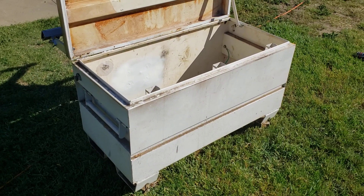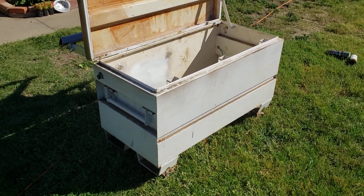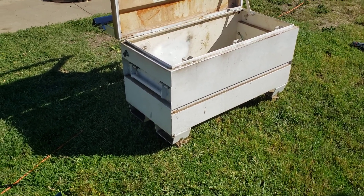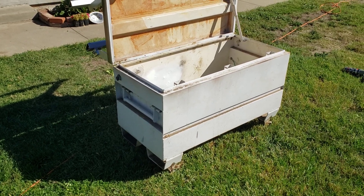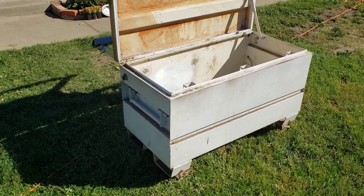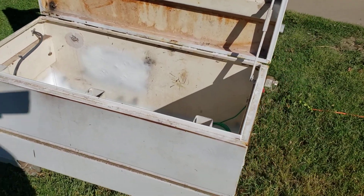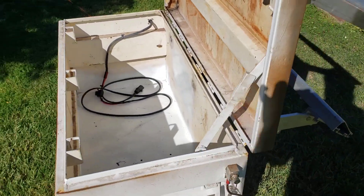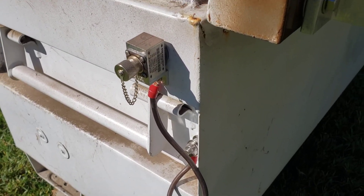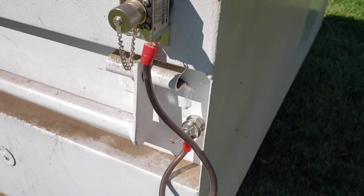Here we have a job box — one of the smaller ones. If you want a more permanent site for your repeater but don't want to build a concrete building or put in an overseas container, you can put your radio equipment inside a job box. You don't need any venting if you're using a lithium-ion battery, but if you're using lead-acid you definitely want venting. The coax coming into the box has a Polyphaser, which is a lightning arrestor and EMP filter.